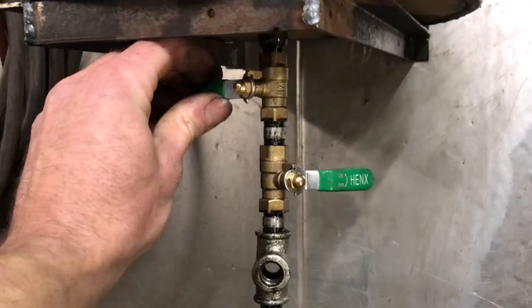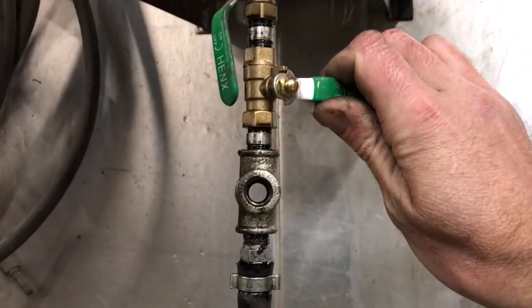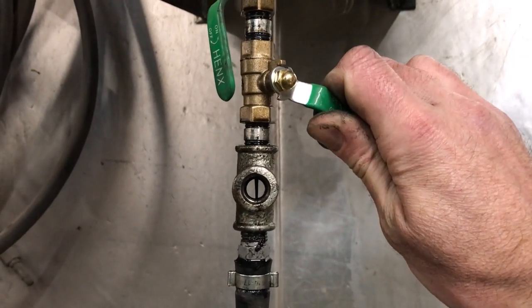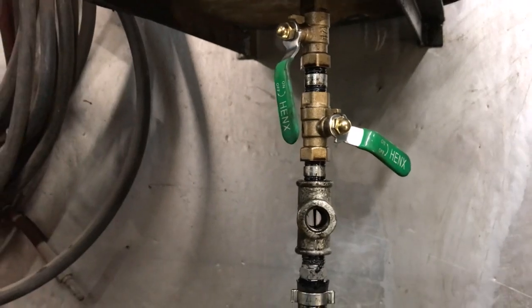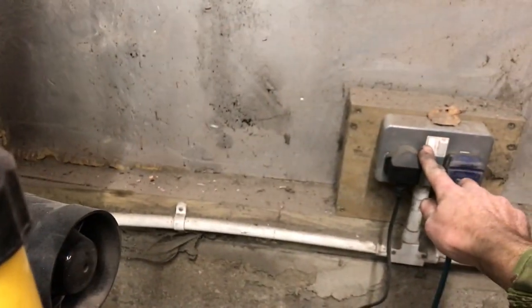Then turn on the oil flow and the fan. There will be a bit of smoke on getting it to temperature, but when it's hot there shouldn't be any smoke at all. Smoke-free running occurs when there is enough air getting to the burn chamber. Mine can do with a bit more air, so I've ordered a more powerful fan.